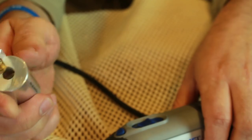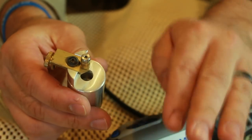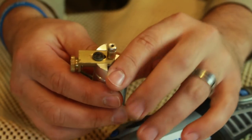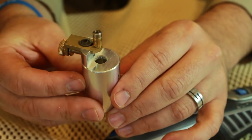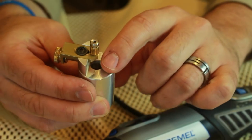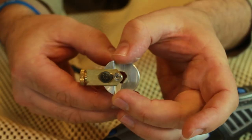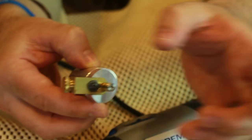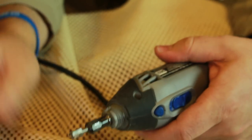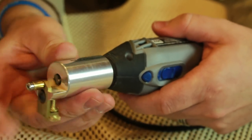The reason why I use that is because with an arch top, it's hard to reference to a straight reference with a bigger router. So with that, you just have to hold it straight to your edge and it references from here. And then you can reference from the two pieces here as well for your depth. And then as you move along, it cuts the channel. So all you have to do basically is to set this to the proper height and then screw that on.